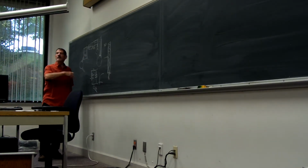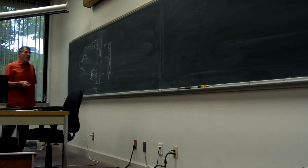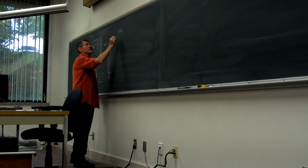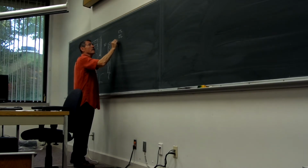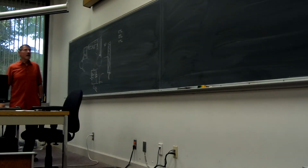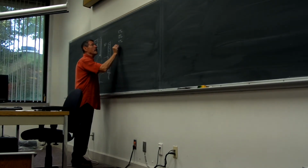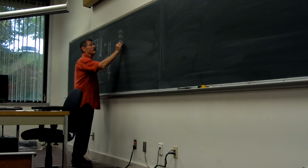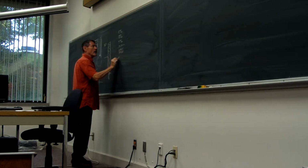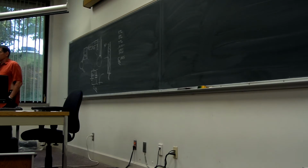So this was a kind of a physical look at a logic system, but we want to use electrical components. Okay? So there were several logic families. There was RTL, resistor transistor logic, then diode transistor logic, and then we went to the really first popular one, some 40 years ago maybe, TTL, transistor-transistor logic, and then went to MOS, metal oxide semiconductor type of logic, and typically they were called NMOS or PMOS, and then we went to CMOS. CMOS stands for complementary metal oxide semiconductor.